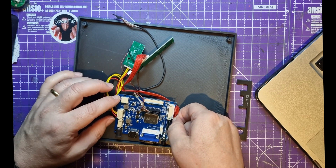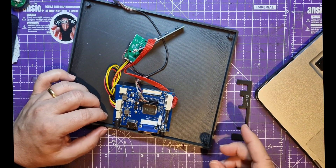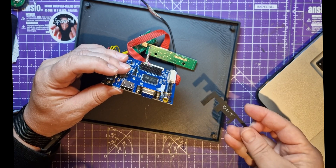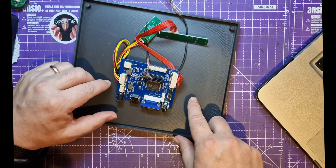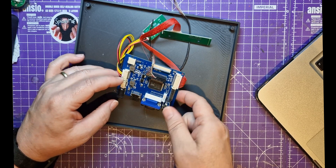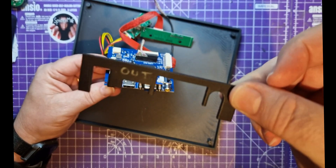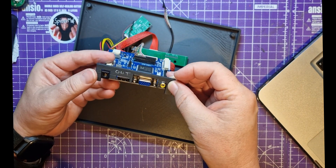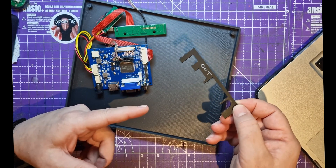Let's just quickly work on the case. This case I did isn't big enough - it's slightly shallower than it should be. I have adjusted it in OpenSCAD. The next thing to work out is putting the holes for these ports on the side of the case. I found an STL case model to put this in but it wouldn't fit, and I tried to hollow it out in Bambu Slicer but it just wouldn't work. So I decided I was going to bore the holes out in SCAD instead - then I've got more control of where they go. I did get this little part which I chopped out of the original model for the case and used that to fit in there, so I knew it would be the right size, then I measured that.